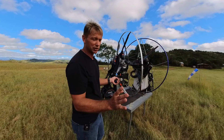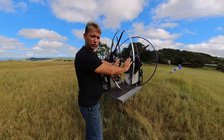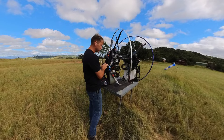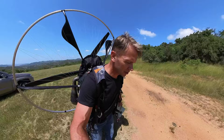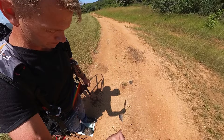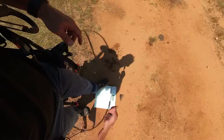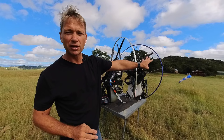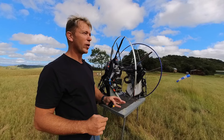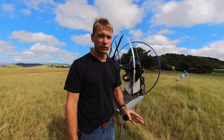To prepare for that same 3.8-hour flight where the Parajet needs 25 liters, the Nirvana only needs 13 liters. The scale with 13 liters, my body weight, and a reserve chute reads 121.4 — about 122 kilos compared to 135 kilos for the Parajet setup. That's a big difference. And it gets even better — if I fully load this machine it gives me five and a half to almost six hours of range at full trim speed.